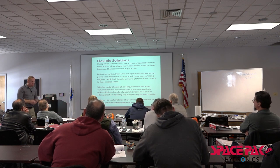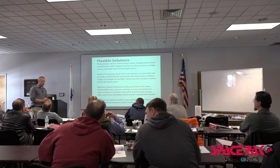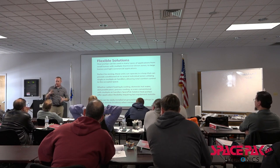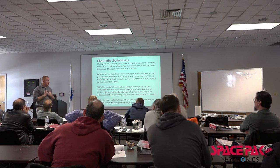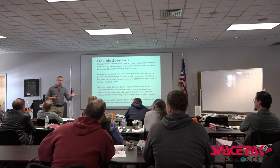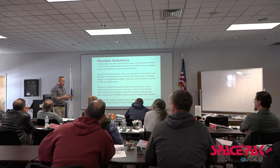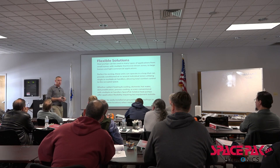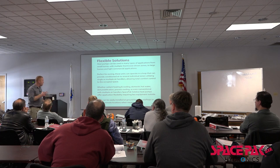What did we say before about our air handler-wise? For a DX system, we have a lot of things to worry about with zoning, right? We want to make sure we don't freeze, and we want to have enough air. Well, if we take our air handler, like we saw before, that has a chilled water coil in it, and we want to run 47 degree water through there, we could run that all day, whether there's one zone or five zones on it. It's never going to get any colder than 47 degrees. It's very easy to set your temperature and know exactly what you're dealing with. No fluctuation.